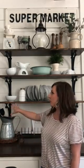As far as spacing between shelves, we have 18 inches between the countertop and the first shelf, and then 12 inches between the top 2. That has been perfect spacing for us and for this area and for what we use it for. And we did 3 shelves high just for visual appeal to kind of fill the space up good. And the top shelf is hard to reach, so it is home decor only. And the bottom 2 shelves is where I place our regularly used dishes.